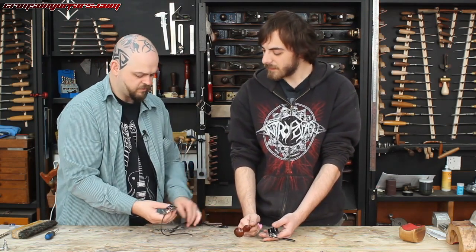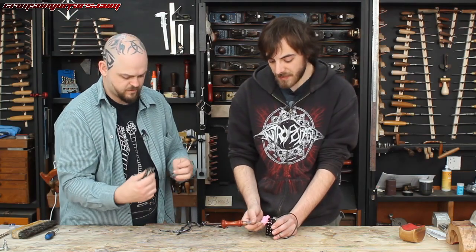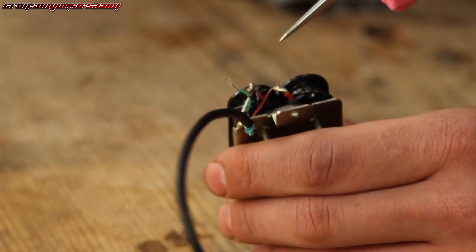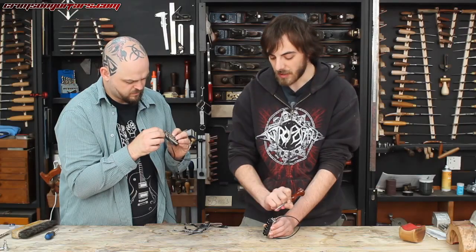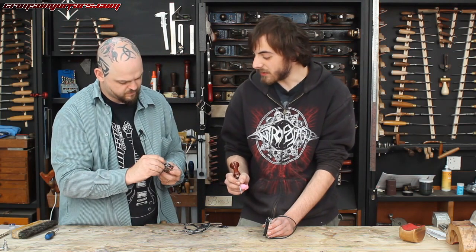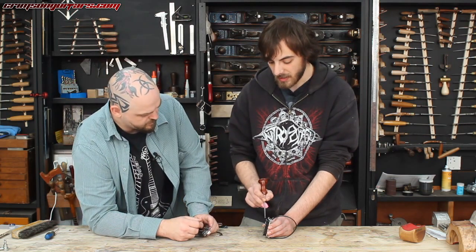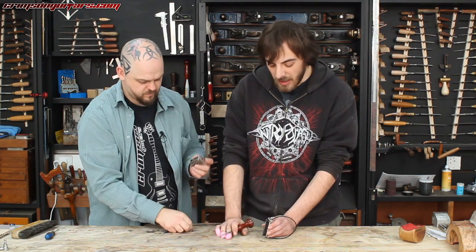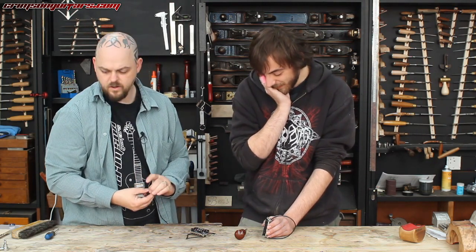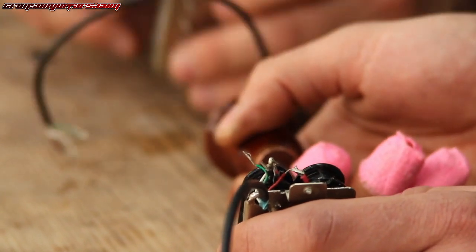So essentially, do we now have a single coil? Or is it just not going to work? It's definitely going to be much weaker. Here we've got a bobbin that is touching and a bobbin that is not. The problem is that the shape of the magnetic field is strange, because it goes up and then goes down really quickly. It will close itself anyway, but not properly. It will go from here to here, leaving out this bit. You might have kind of a single coil. This bobbin will be magnetized anyway, but it's just weaker.